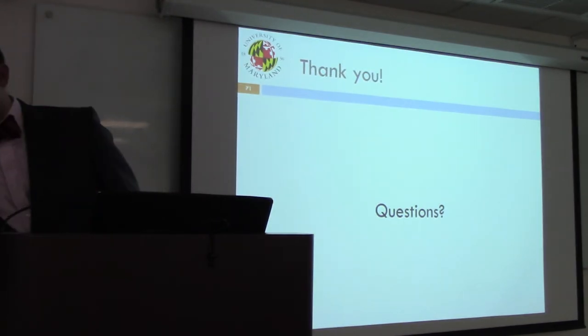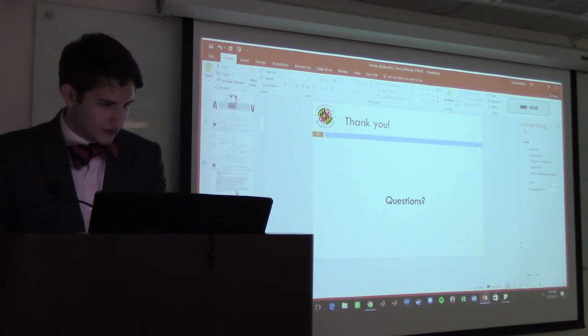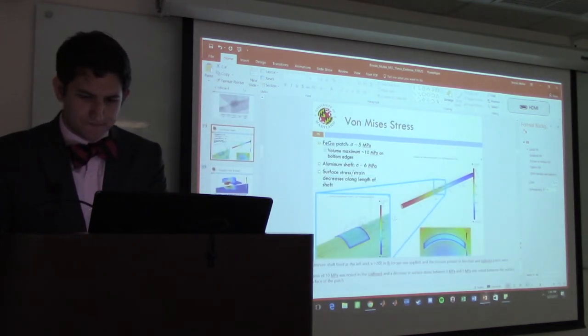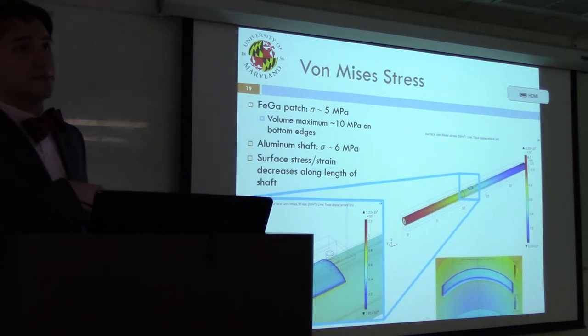A question asks to return to a previous slide — a COMSOL model of torque distribution on a rod. The color bar represents different values of Von Mises stress. The loading condition is 200 inch-pounds applied radially. COMSOL splits circular cylindrical objects into quadrants when rendering 3D figures, so a quarter of the desired load was applied radially in each of the four sections — totaling 200 inch-pounds in the positive direction.